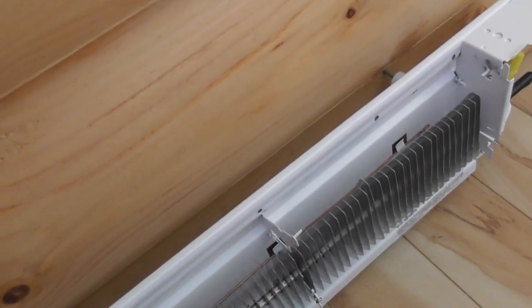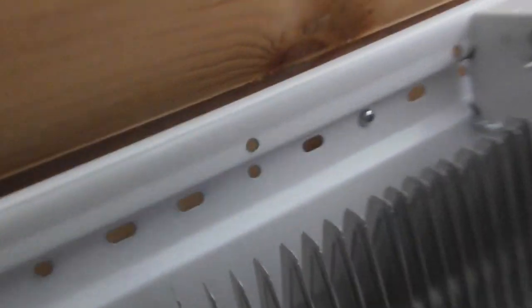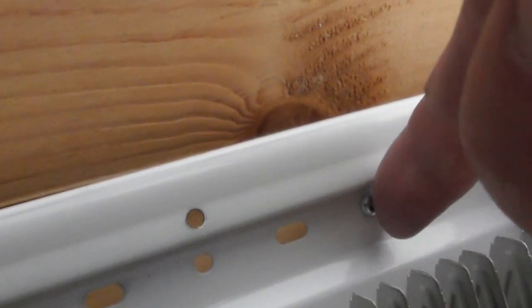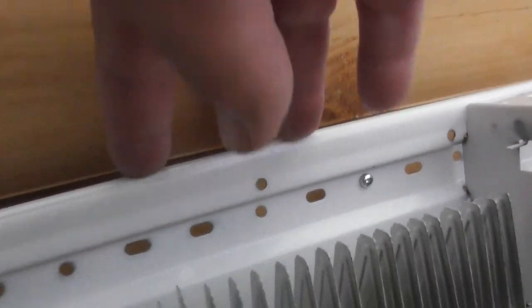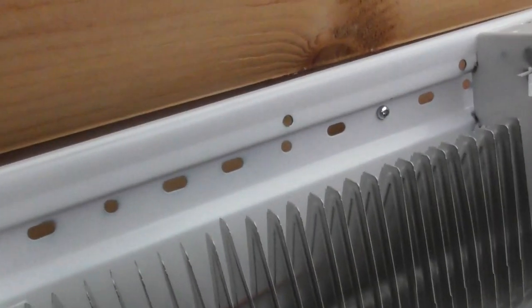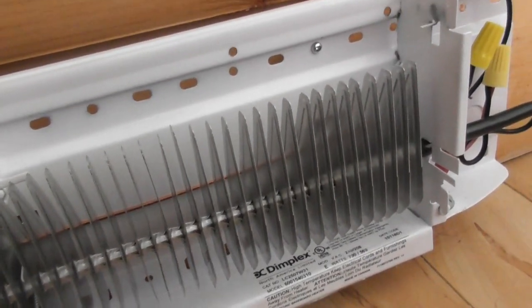Big thing you want to do: I've got a helper — say hello! When you tighten the screws in, back them off a half a turn once you've got them flush. Otherwise you won't allow the frame to expand and contract, and you'll get noise — it will go clink, clink, clink. So read the instructions; that's what it says. Let's put it together and see if it works.